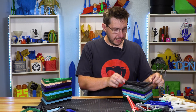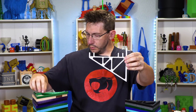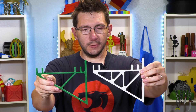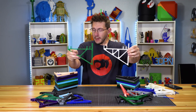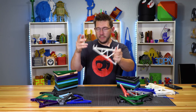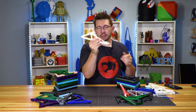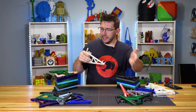Now let's talk about this bracket. Look at this bracket right here. If we want to compare against last time, there are more trusses within the bracket, which used nature's strongest shape according to my nine-year-old — the triangle. And it holds phenomenally more. In stress analysis tests in Fusion 360, just putting pressure here and holding this here, it held quite a bit. In fact, if you take the old one and twist, you can see it twists and bends, whereas this new one does not. The entire structure here is more sturdy. It's a better bracket.